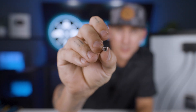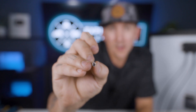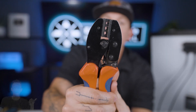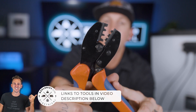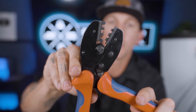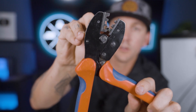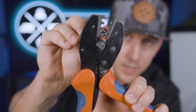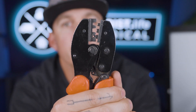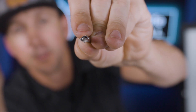The metal electrical connector on the inside of a PV connector is called an open barrel connector, which has a U shape. This is the crimper that we're going to use for open barrel terminals like PV connectors. The jaws of the crimper have a U shape on one side and an M shape on the other side, and we're going to be fitting the connector so that the U shape fits on the U side of the crimper.